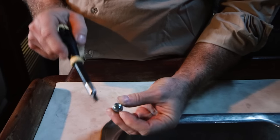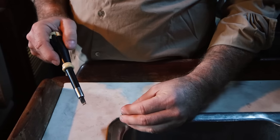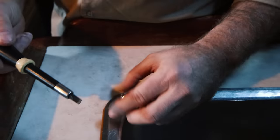Neoprene and stainless washer, 316 round head bolts. Also T-nuts for them to go into. All from McMaster-Carr, special order. And it's worth it because you gotta do it right and it looks shippy. This used to be marine adhesive on here. Now we have a nice gasket and some really great hardware.